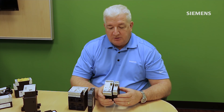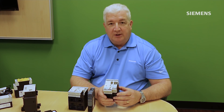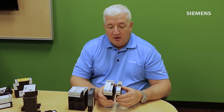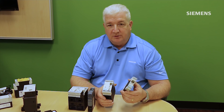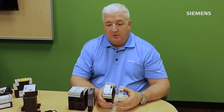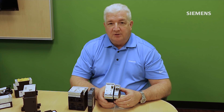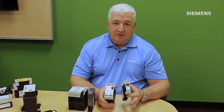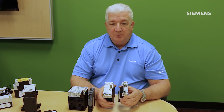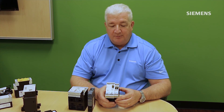By doing this expansion, the Simicode instead of just protecting your motor can now more or less protect your process by having very increased visibility into your system — looking at local sensors such as tank levels or temperature levels, vibration levels of the environment around your motor. Simicode can now give you early warning signs as to the health of your system. For example, if today it's running at 8 amps and tomorrow it starts running at 9 or 9.5 amps, Simicode can reflect that as a warning condition that something has changed dynamically in your application.